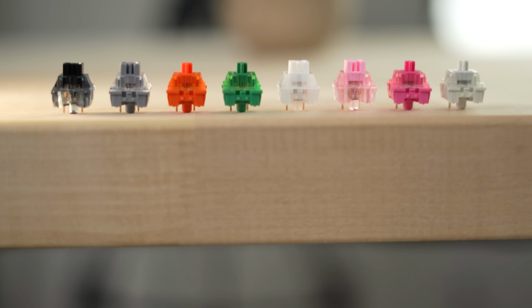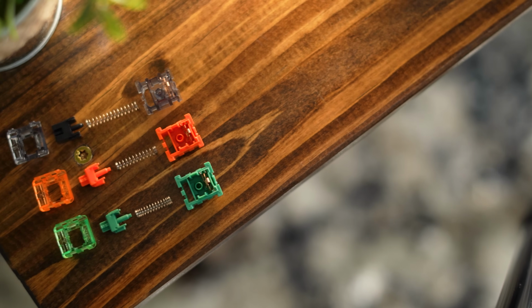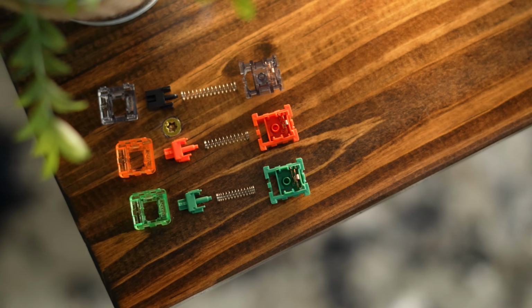All right, before we go over my overall favorite switches of all of the Akko switches, you have to know about these interesting facts you really need to know. Firstly, all of the Akko switches have a longer stem, so interference is not an issue on any of these switches with cherry profile keycaps. Don't even comment below that it will still be an issue. It is not. I have tested every single one of these switches. It is not an issue. Interference is not a thing with these.